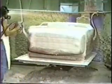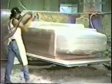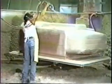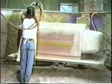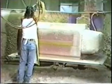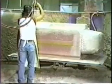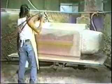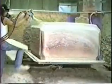And so we only use 0.125. We're bringing between 25 and 30 thousandths to the bottom, which is a lot better than most people, who are using 187. The other advantage of using a thinner sheet is it's much easier to keep the flanges straight, and you do not build as much tension into this shell.